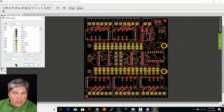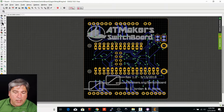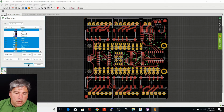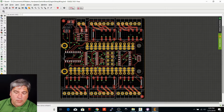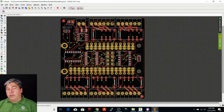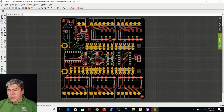All right, so on the bottom, we have these things that look like components. They look like things that would need to be placed, but they're actually just cuttable traces. So they were asking about those. They didn't understand them. And then on the front, what they're really going to place is going to be these. So this is a relay driver, the I2C port expander, the current sensor, a couple of capacitors, a couple of resistors, and the 5 relays. Oh, and the button and the LED. So the things they're not doing are going to be everything along the outside, and then the big headers here for the feather. So hopefully that will explain it.